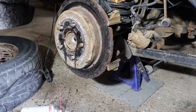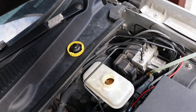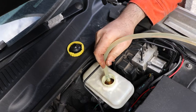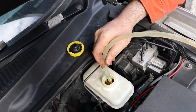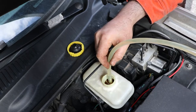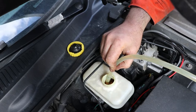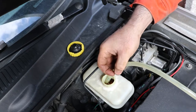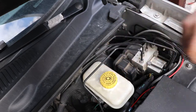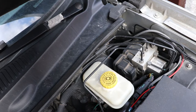I'm going to take off the last brake rotor and top off my master cylinder. I have a MightyVac vacuum and I'm just going to suck out a little bit of fluid — show you how easy it is. Just turn up the pressure and it sucks it out. You can see it's back-washing a bit — you want to avoid that. But it's cleaning out the hose and you can see how easy that is; you don't need to risk getting any brake fluid on anything. Now that I've got that taken care of, we'll go back and take out the last rotor.